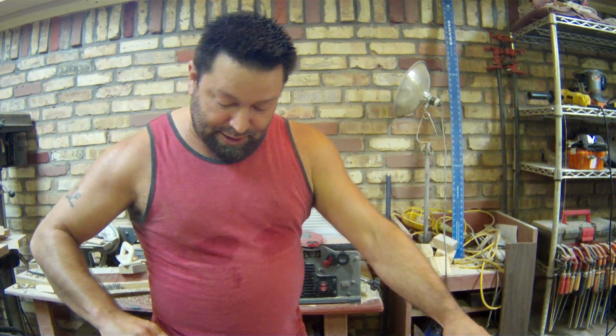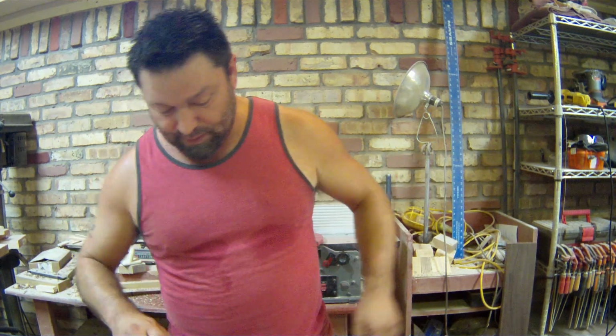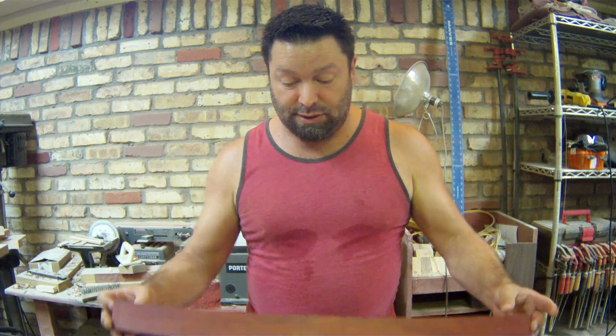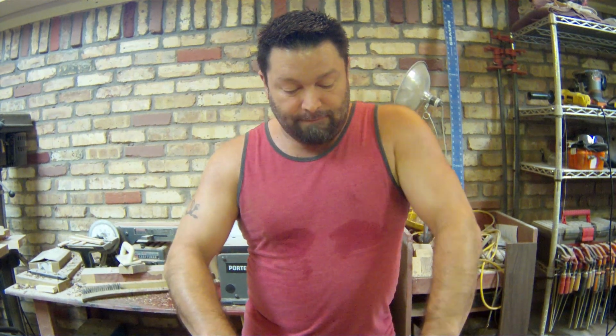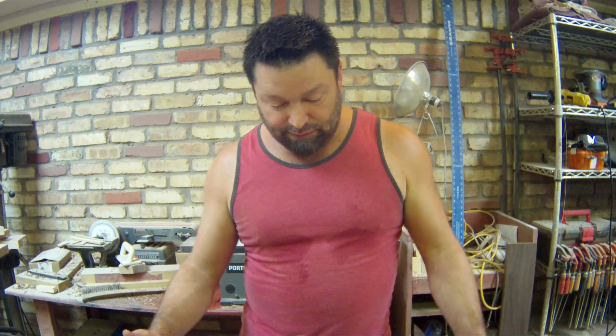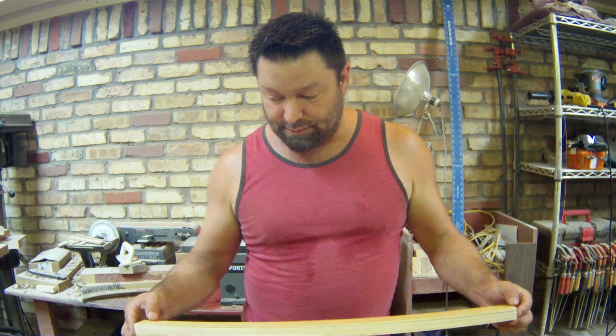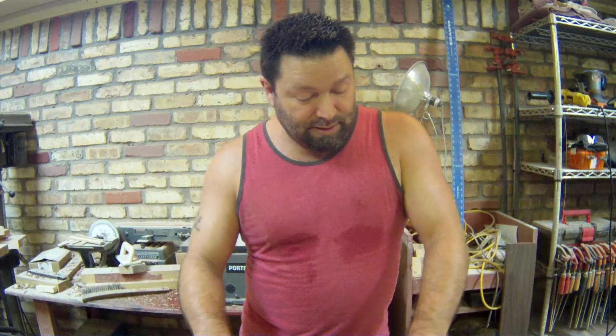So anyway, while you were busy charging, I went ahead and glued up our rails and runners. At the current state that we are, these are nice, and the rails are nice and flat. So these are ready to thickness walnut down. And I think that is a lot safer and cleaner than trying to thickness those by themselves and then glue them on. So effectively, our 7-piece neck is 3 pieces now. I was thinking about trying to plane the taper into this, and I still might, but I think we're gonna just go taper it the way we normally would. I think.